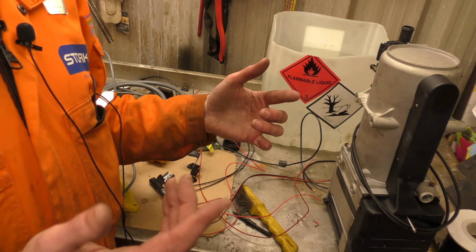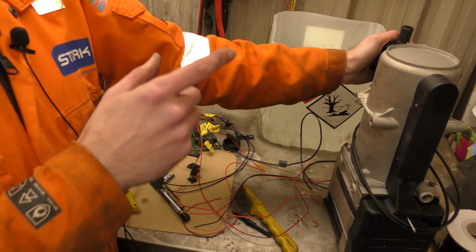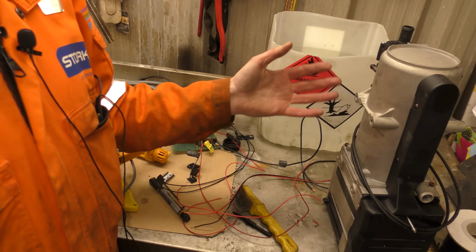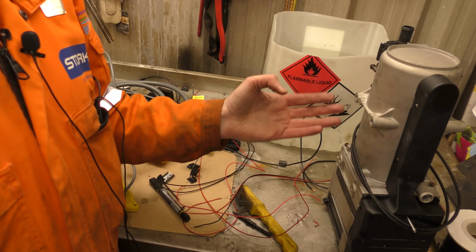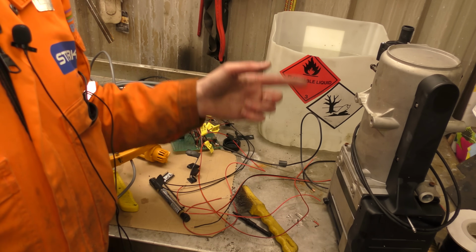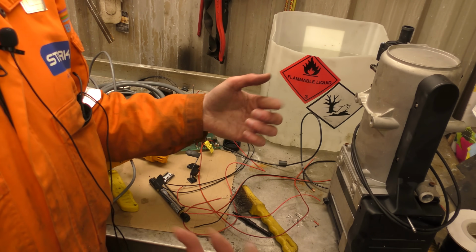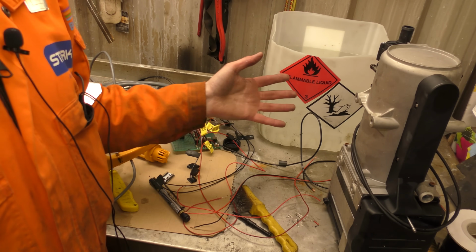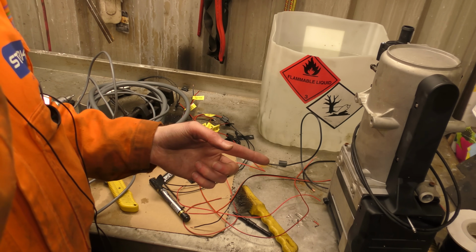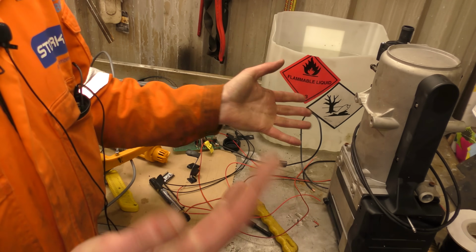Doing it from a tank, I'm still not entirely sure. With a standard setup, with a standard pump, I think there's too much flow. It goes too fast for the heater. We had the 25 litre and we used a quarter of it just heating the thing up and getting it primed and running. So unless you're planning on having really, really short showers, you also run the risk of running all the water out of the tank. So you would need some sort of system that either cut the fuel pump so it stops heating up, or some other way of controlling it, because you don't know how much water you've got versus how much time you spend in the shower. I know it's a bit risky.